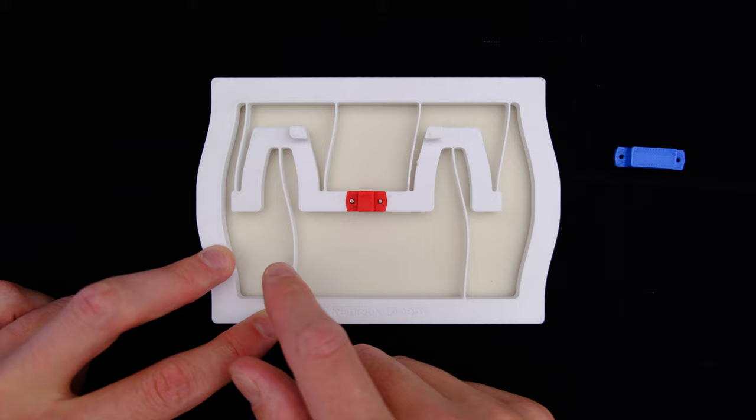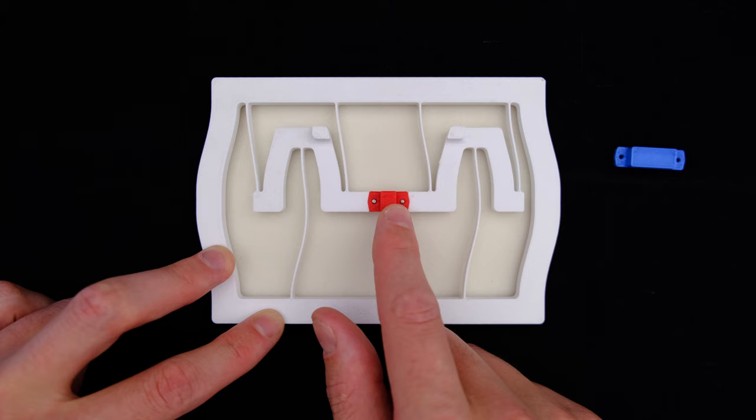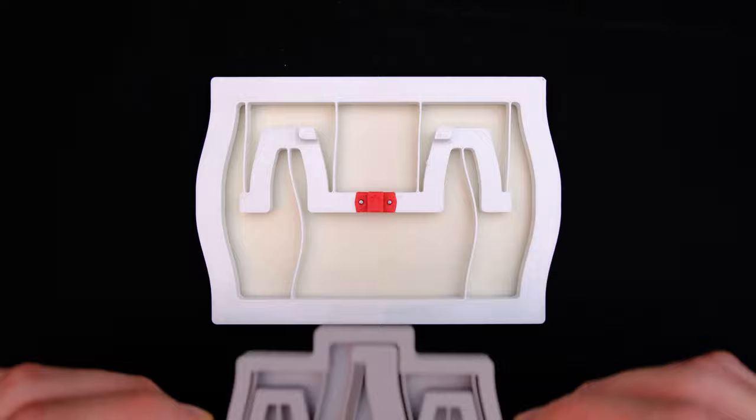You may notice that the system is at best a good approximation of zero stiffness, but not really perfect. This is because the two individual stages are not exactly constant force, and the middle section of the force deflection graph still has some nonlinearities. Also, imperfections from manufacturing and modeling and the nonlinear material properties of the PLA cause the stage to not sit absolutely still. By replacing the insert with a mechanical switch, the design is made monolithic and is easily scaled down.